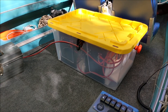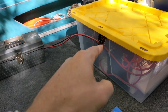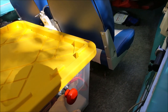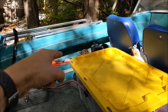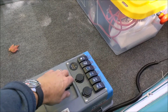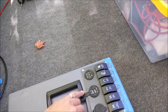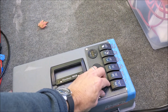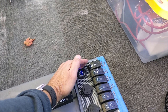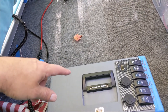Another view of our battery bank - just a plastic container I bought at the hardware store, with a hole cut for these wires to come out. We have an e-stop switch, which is really important to have for this stuff. The fire extinguisher is on the other side. This is a little kit I put together that runs the bilge pump and the lights - bow light, stern lights, USB charging, and a cigarette lighter plug. We've got a readout to see our status. The battery is a little 35 amp hour AGM battery in that box.